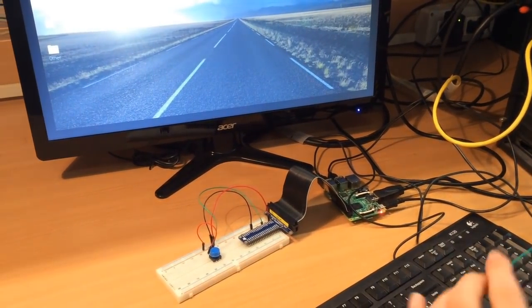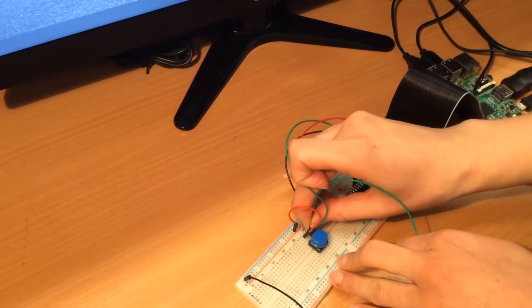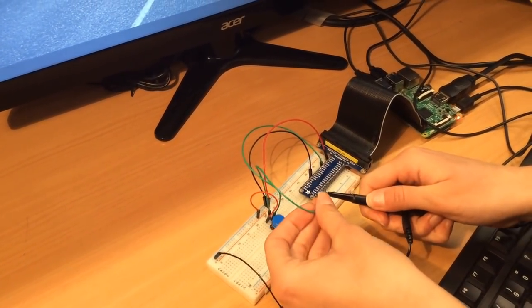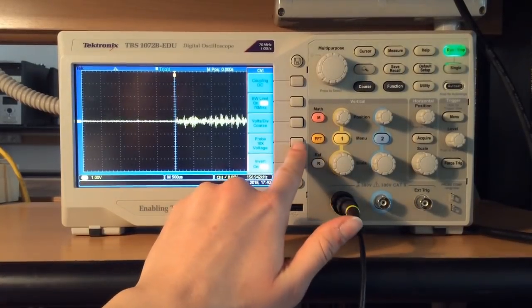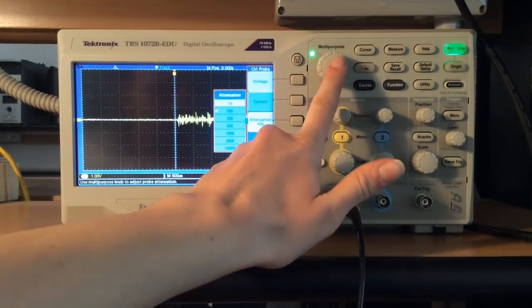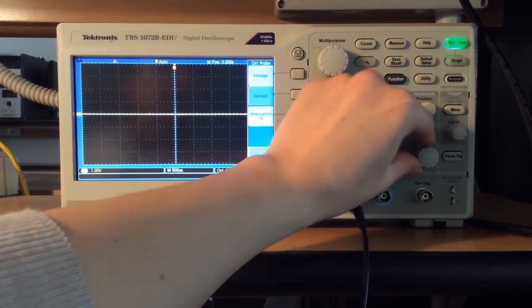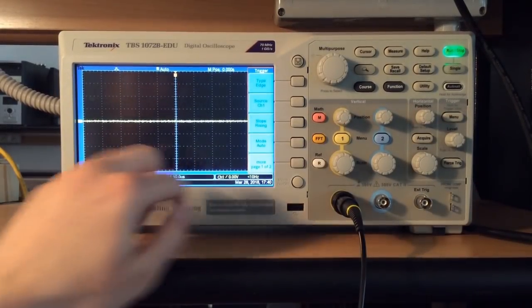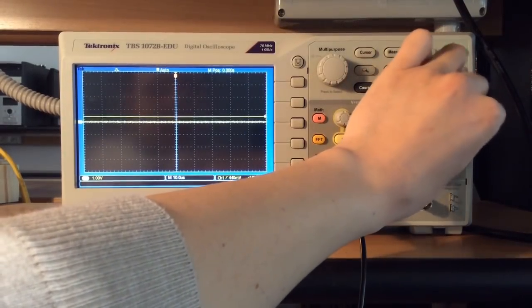To see in more detail what happens, we use an oscilloscope. We need two wires: one for the ground and one to reach the level of the leg of the button. We take the probe and connect one to ground and one to the button. Remember to put the attenuation to 1x on the probe and channel 1. Then we set the vertical scale to 1 volt and the horizontal scale to 10 microseconds. We set the trigger using the menu button — we need a type edge on channel 1, a rising edge, and we set the level to 2 volts.